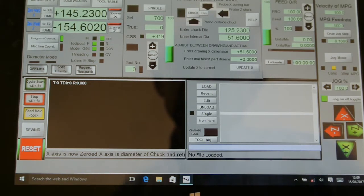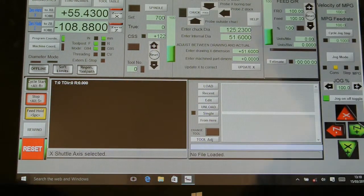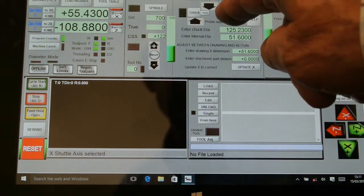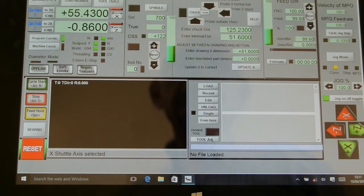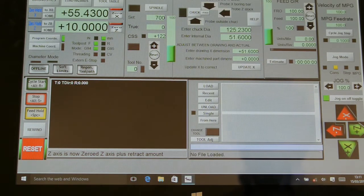When I set this up, I made sure the chuck was set at 100 — it was accurately measured at 125.23. I machined something and then checked with the setting and adjusted it slightly until I got it to cut absolutely perfectly. And now I'll probe into the stock at the end. Okay, that's zeroed on the X-axis and it's set dead bang on the centerline by probing.